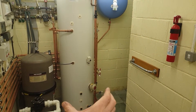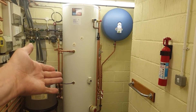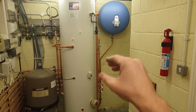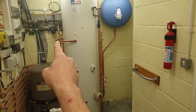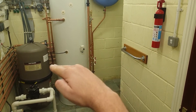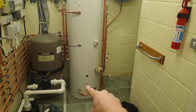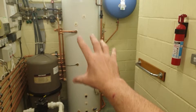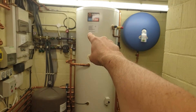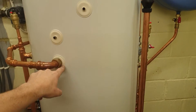What I've done here is specify a bespoke cylinder — notice it's long and slim for stratification. We could have had a short, fat 350-litre cylinder but instead we went long and slim so there are more stratification layers. With ground source, because flow and return temperatures are lower, you need higher volume for lower-temperature hot water. There's a ground source coil in here, and down below there's the solar thermal coil which needs a cool stratified layer to work efficiently. The secondary return tapping is taken right down low, done in a one-inch or 28mm tapping rather than the usual higher position in 15mm.